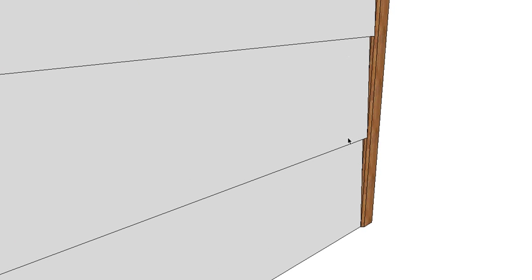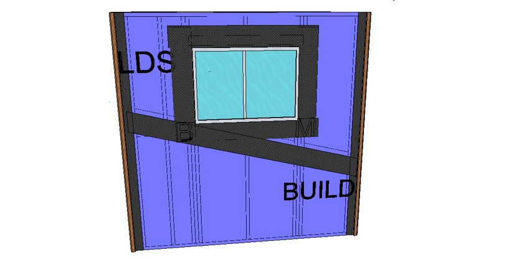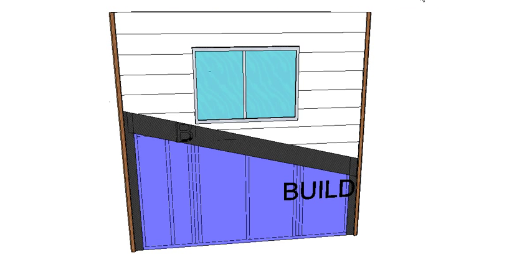And you'll notice if we go down here that with that kicker, all the boards are sitting at the same angle. This one's not flat against the wall. Around the corner here where we had our roof that's going to butt in, got a flashing running down the line of the roof. This will eventually get folded up over the roof to provide a flashing down there. So our boards get put in as such. Once again, you would need a very small piece of timber under this corner to provide a kicker for that, so that they all sit at the same angle and they're cut at the line of the roof.